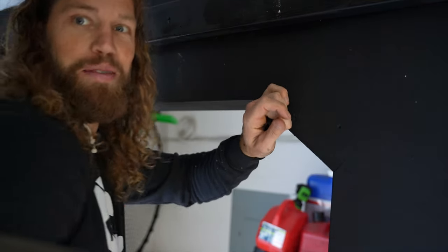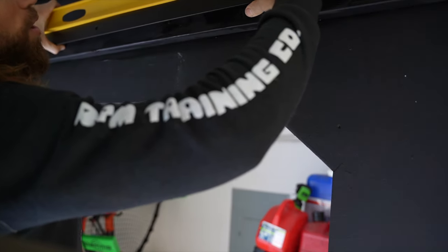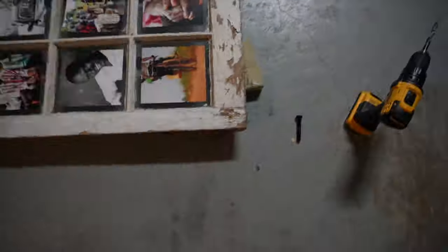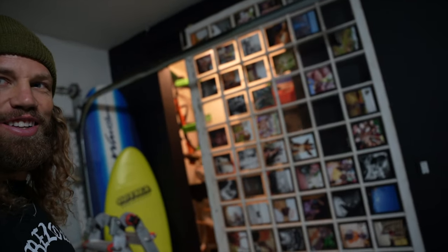Almost fell — we're back. It's super important that the track is level because if you don't put the slider on level, the door will sag and always swing open or always close. We took a dinner break and now we're back at it. To make this window pane into a door I need to drill holes through it for the housing. I pre-drilled first, then drilled the big hole. I can't put the TV up tonight — too loud and too late. But check out the barn door — it has an automatic close on it!